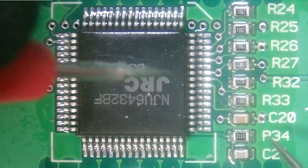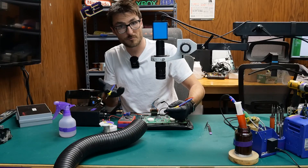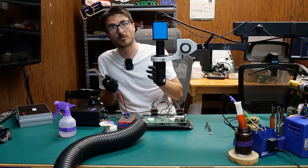If we ever have issues with lights not working or the display, this IC chip is in charge of it. If any of these resistors fail that could cause this IC chip to malfunction and that could be why our lights are not activating. Starting with R34 — 5112, that's 51 kilohms, and that one's good. R33 — 1002, supposed to be 10 kilohms — that one is open. The 821 resistor is in circuit so it's showing a lower reading of 334, which is expected. The 680 ohm is showing 64, also okay — we just don't want to see it open. This 1002 10 kilohm resistor is open. The next one is showing exactly 9.99 kilohms — good. And the top one has also failed open and will need to be replaced. So we've found four defective resistors: three for this IC chip and the 100 ohm resistor next to the clock.